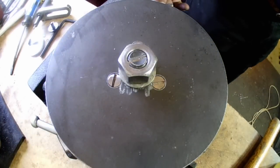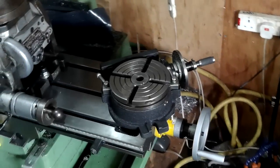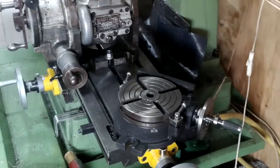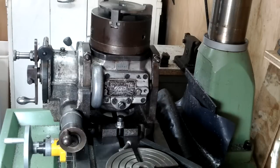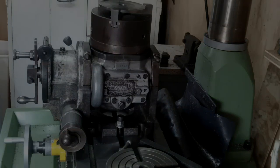I've still got to drill approximately 3,500 holes to complete the index plates. It sort of makes me wish I'd got a CNC milling machine. Before I can drill the holes, I need something to drill the holes with, namely something to index the holes on the plates, and for that I've got 2 devices, a 40:1 Kearney and Trecker dividing head and a 90:1 dividing table.